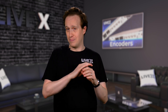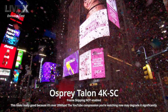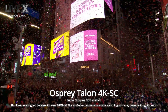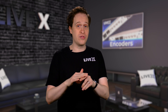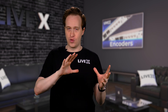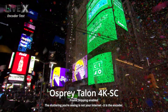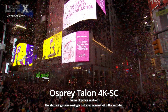And then we have the Talon, which was both the best and the worst at the same time, because it either cheated or completely failed. When I was conducting the test, I thought it looked great, until I noticed that YouTube complained about a high bitrate. The Talon has no way to enforce a strict constant bitrate, but this only came out during the confetti. For example, if I replaced the fleet of Haivision Makito X4Es that currently do our New Year's Eve show with a bunch of Talons — that's about 40 channels of encode in total — the near quadrupling of bandwidth that would happen just after the confetti drops at midnight would take down the entire show at the worst possible time. If I want to prevent this, I would have to turn on frame skipping, but that is not an elegant solution and it should have better options. Most encoders have more seamless ways of handling this. So, the Talon's disqualified: it either looks great or it looks awful.